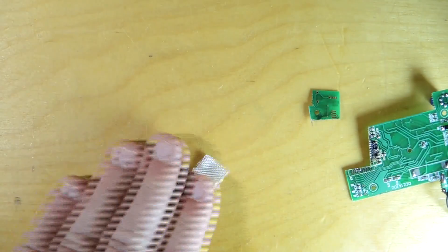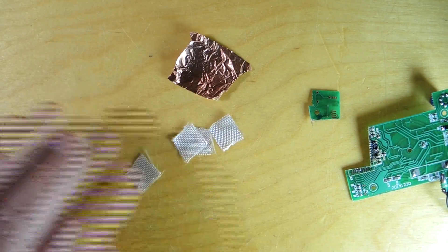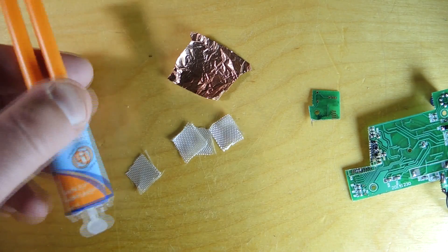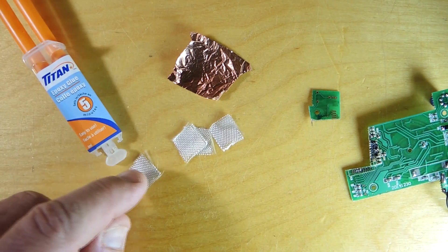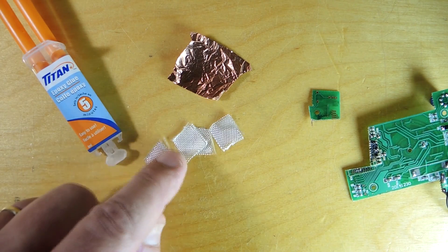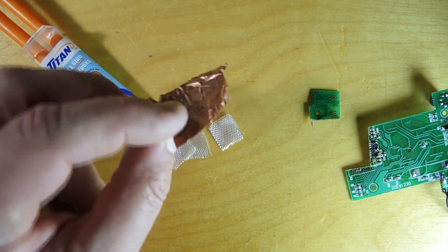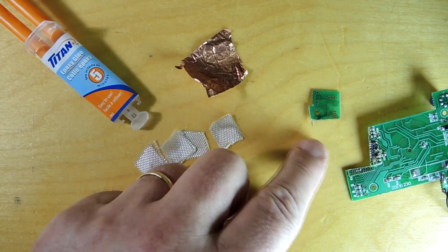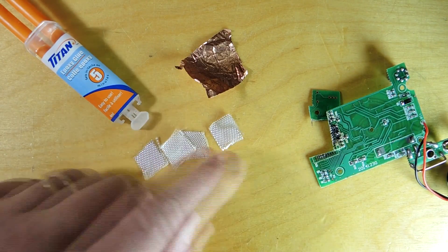This circuit board is essentially a copper laminate of fiberglass, bonded with epoxy — not too unlike what you get in this little syringe here. The epoxy is squeezed around the fibers to create a nice sheet, then copper foil is laminated to both sides. Eventually it's etched in chemicals to create the traces, and the green solder resist material is applied.